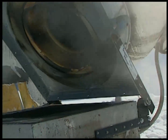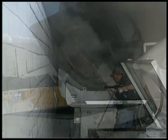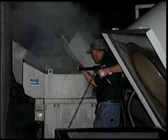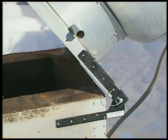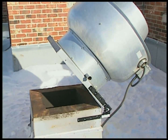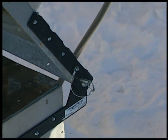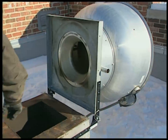The pin is locked safe and secure, and so is the fan. Another problem with the chain or cable is that it's always getting in the way. It impedes access to the fan, which means routine service calls can take more time. The Super Hinge allows unencumbered access to the fan. In fact, the Super Hinge can lock the fan at either a 45 or 90 degree angle for even more versatility in the cleaning process. You can also lock the fan in a closed position for security purposes.